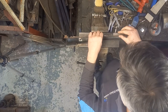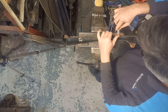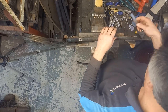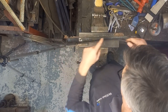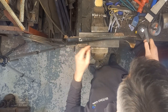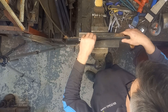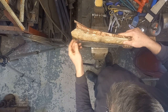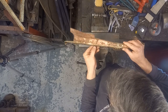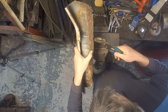We're looking at a flange about 15 millimeters all the way around. What I'll do is cut a strip — after cleaning all this up — 15 millimeters wide and long enough to cover all of that. Then we'll tie that down into the car where this should be, screw it down into the car and tack it with this, then come back to it. But first thing is we need to clean this up and see how much we've got left.